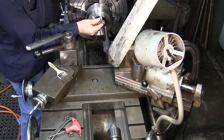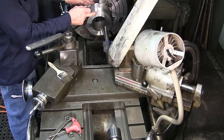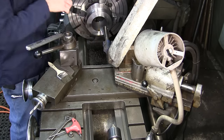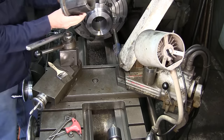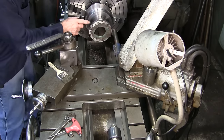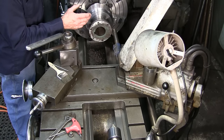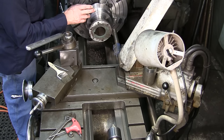I just checked this — we're getting our inside micrometer reading for 3/4 inch per foot. This is four inches long, so it's basically four inches here and three and three quarters here, and we're working our way out. We've got our hub cleaned up and deburred, and we've got a couple inches to make up. We're sneaking up on it because we only want to do this once.